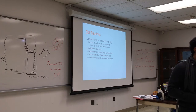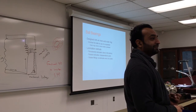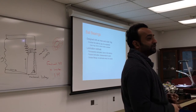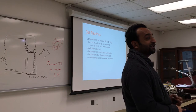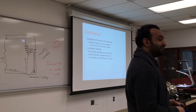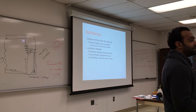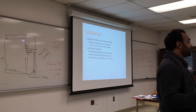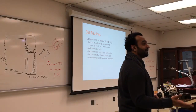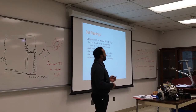That's why if you want to store a car for a long time, you want to drain the tank. If you store it more than 1 year, you want to drain the tank and empty the engine of oil. There's a lot of procedure you can do to keep the car preserved. And with some cars, when you store it for a long time, you don't want the car to sit on the tires. Over time, being in the same position, it will cause the tire to bulge, and when you drive the car, it will be wobbly. So storage is another thing you have to think about.